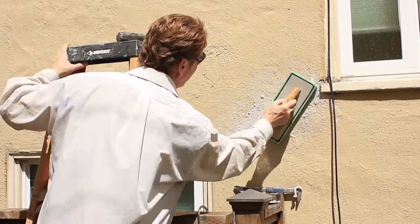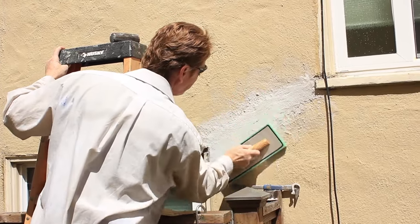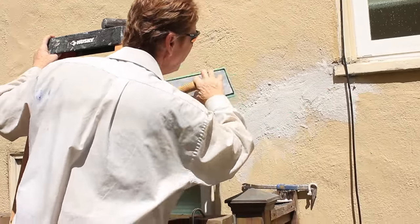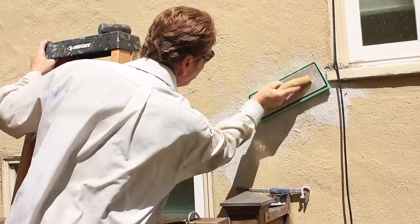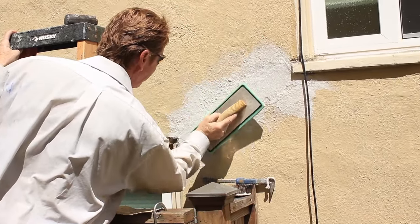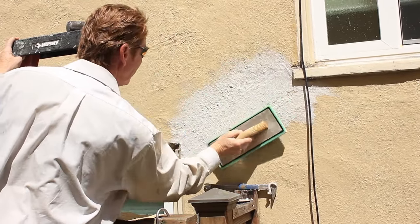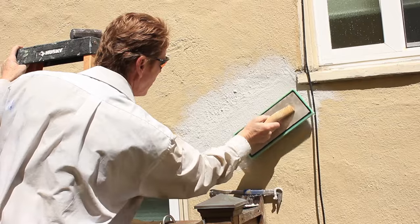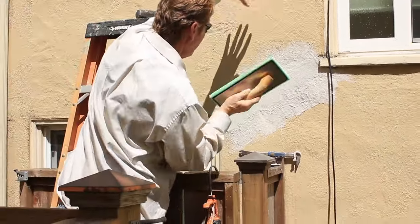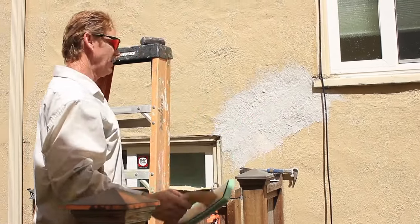Put the putty knife down and add a little bit of water on this. We just float that up, tie it in, pull it into the painted surface. If you want more grit, just put more circles. Just like that. If you want more, you can even tap it like that — that really brings the sand finish. We're not only matching this right here, but we're tapping it and softening it. There it is. That's how I would do it, guys.